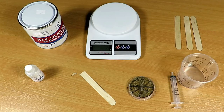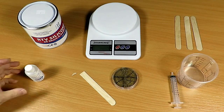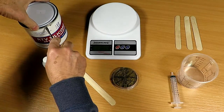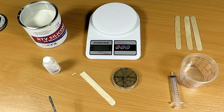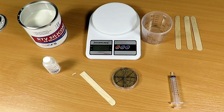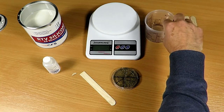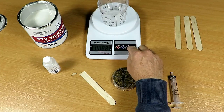So we've come to the time to mix up the silicone rubber. This is going to be a little bit tricky because only a small quantity is required to produce this moulding. We'll open the tin and I estimate about 50 millilitres or 50 grams will be about the right amount, so we'll pop that on the scale and set it to zero.